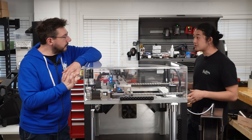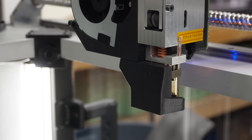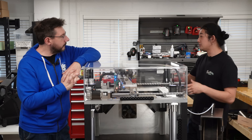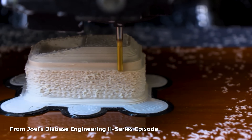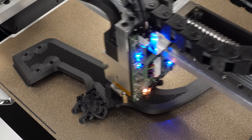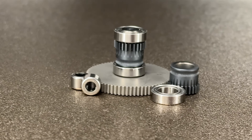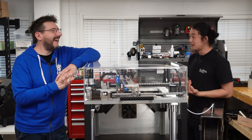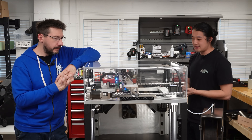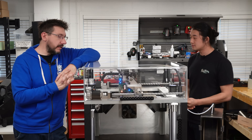A lot of that goes into the motion system, but really the extruder — we had to figure out a way to minimize extrusion and deposition error so we could have it as dense as possible. Riding that line of perfect density is only possible if you can extrude with precision. Part of that was the drive gears in here — we had to QC them to a 10 micron diameter range. It's not much; it makes building things very challenging, but the result is a part with no air in it.